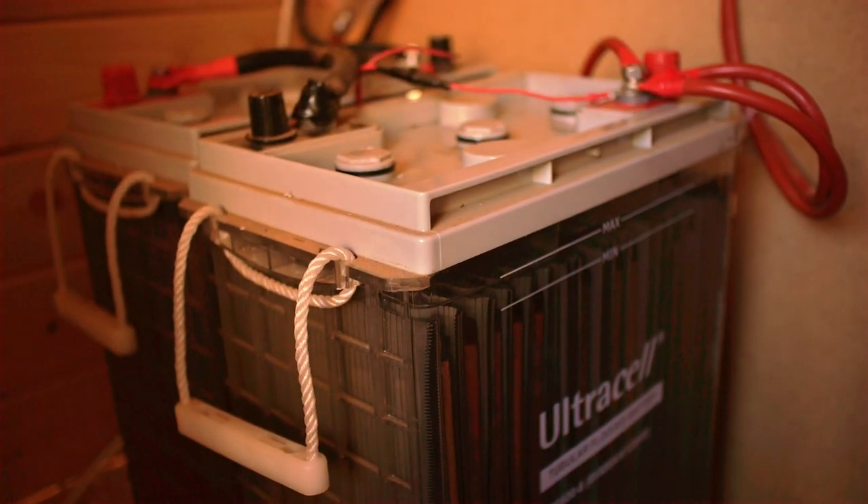In terms of batteries — that's the next thing you'll need after your MPPT. We've gone with the 12 volt system, so we purchased two six volt 600 amp hour batteries and put them in series. Series means it keeps the same amp hours but doubles the voltage, so two six volt batteries in series gives you 12 volts. If you put them in parallel — positive to positive, negative to negative — you'd only have six volts but 1,200 amp hours. Ours in series gives us 12 volts and 600 amp hours — that is a lot of power.